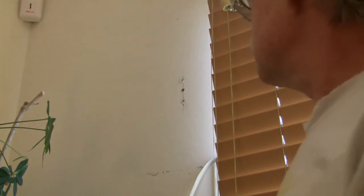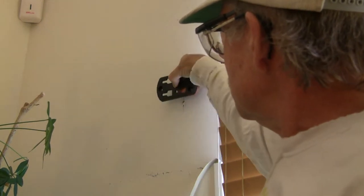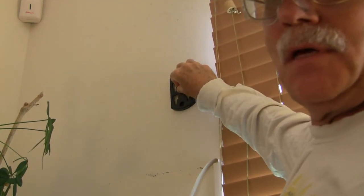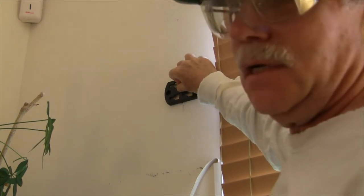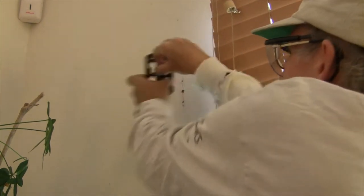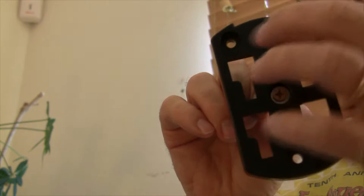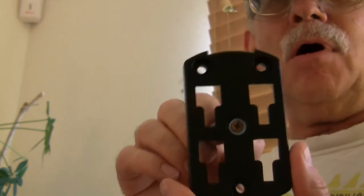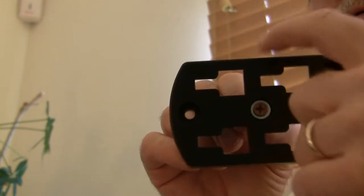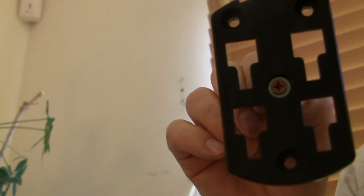The thing I'm going to do is install the center screw first, so I get this thing centered, and then I'm going to turn it sideways. I'll mark the positions of the other screws where they go, then I can turn it sideways and drive those in. Then put it back vertical, and then I can install all the screws. That's my little trick: install the center one first, mark your holes. That'll be more accurate than trying to mark them all without being attached to the wall. Then you can turn it sideways, put your wall anchors in, rotate it back, and it should go right in.